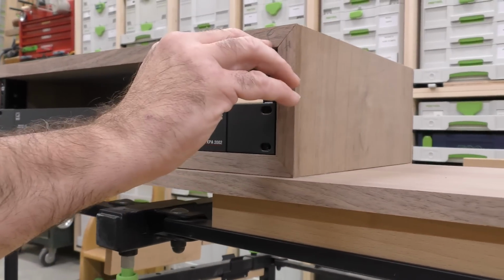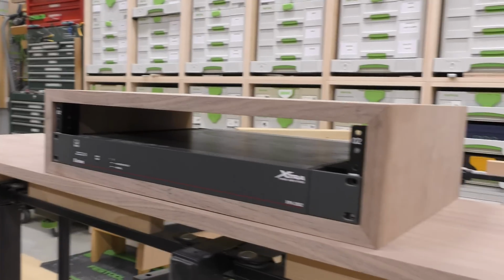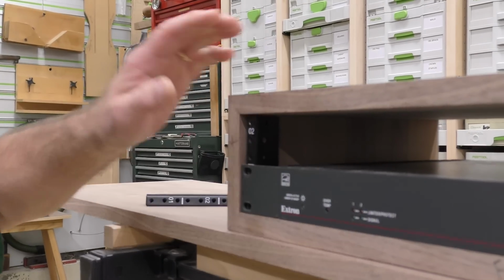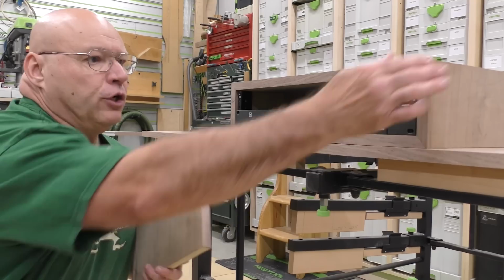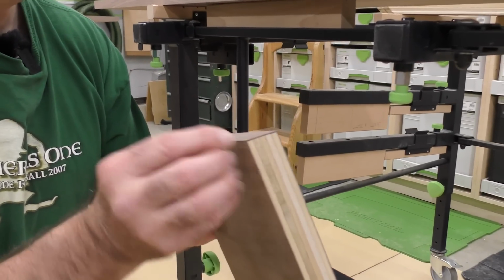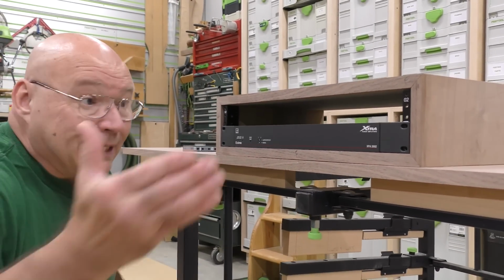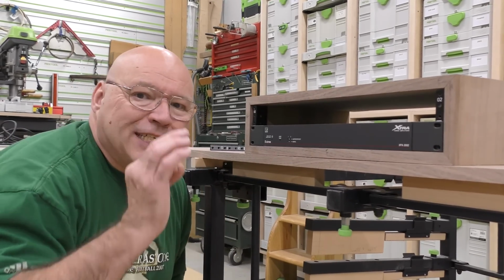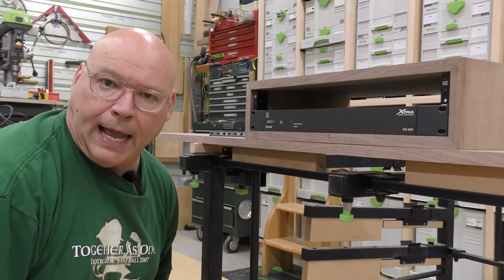This is a 2U unit, so the dimension is determined by the brackets I ordered. There's going to be two more that we're going to build today, and they're both going to be 4U units. They're going to be taller. And we're going to do them out of the same walnut. Here's the point I'm trying to get across. The measurements are not from outside, because that's the miter. The measurement needs to be taken from the short point. So we have that critical measurement. I added basically a 1/16 or 2 millimeters inside for wiggle room. And there is wiggle room here, and these are just attached. These are standards, whether for a server rack or an audio studio rack.